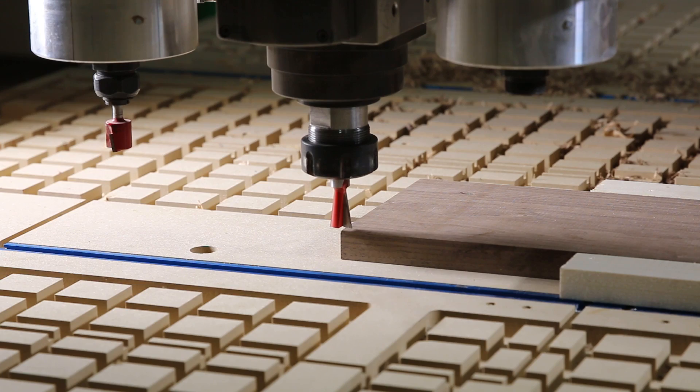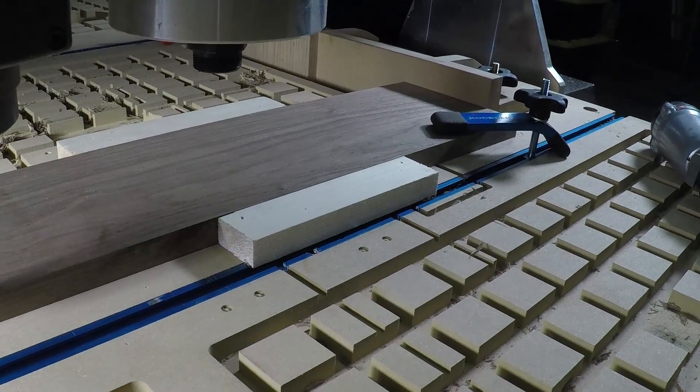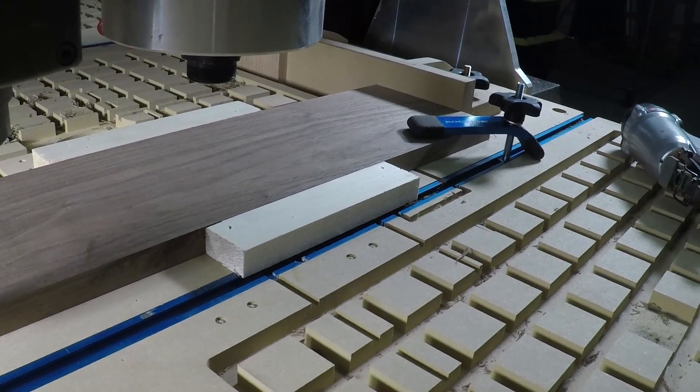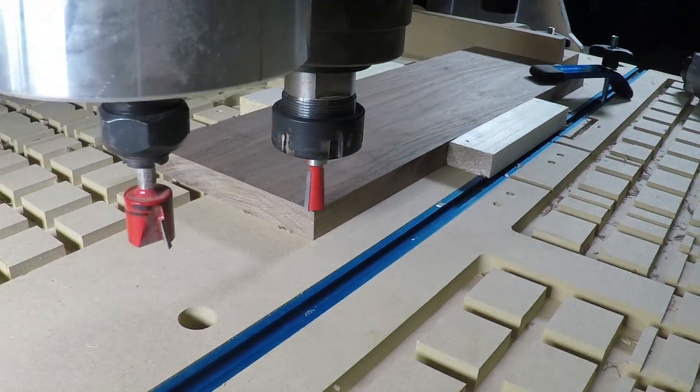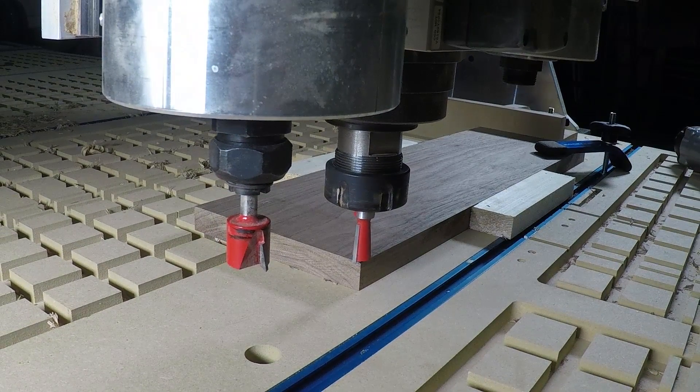For the pin boards, it's a pretty easy jig setup. I've got a couple of boards holding the sides tight, a rocker clamp to clamp it down, and the back pushed up against the vertical vice. I can batch out all of the pin boards — they'll all be the same length, and since they're symmetrical I can flip them and cut the other side. Our zero is the top of the work piece and XY is the upper right corner. The bit is going to come out and go into the work piece. Let's go ahead and cut some pins.